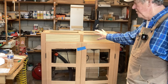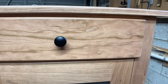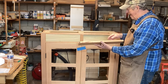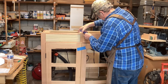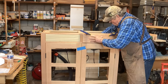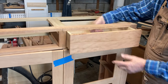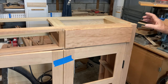Now it's time to figure out the dimensions and how to attach the drawer fronts. I'm going to use a really nice piece of cherry — I've cut it in half and each will be a drawer front. I'm going to overlap the drawer front by three-eighths of an inch all the way around. I've put double stick tape on the back, lined it up, and pressed the drawer against it. Now I've got the drawer front attached to the box. I'll run a couple screws through it to permanently attach it. I'm going to round the outside edge over with a half-inch roundover bit.